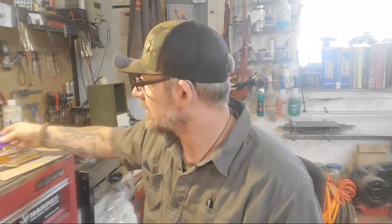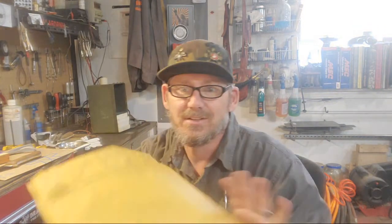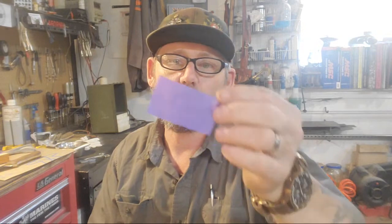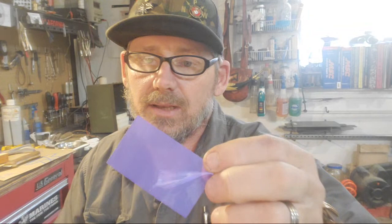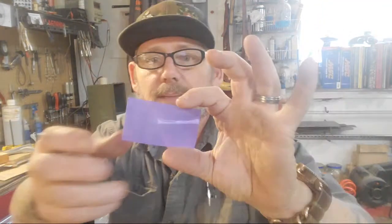I do that by creating my own stencils, and that's what we're going to do today. If you are a knife maker and you want to etch logos or custom work for customers, there's no better way than making your own stencils. You can buy stencils — send in your proofs and they'll send you a dozen or so burned stencils — but it can cost a bit compared to the cost of the stencil material. These are old ones, already burned up, no good. The object is to put some sort of a mask on the material, expose it to intense light, then develop it.